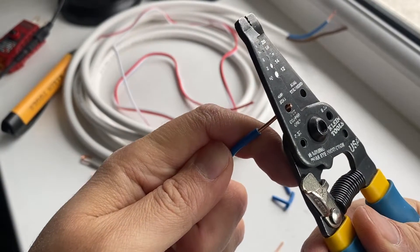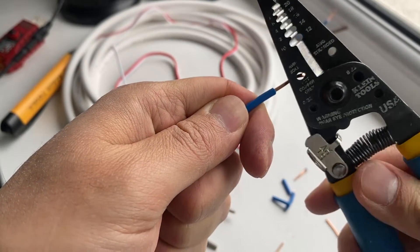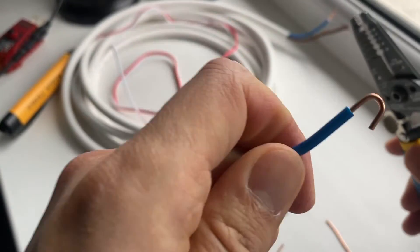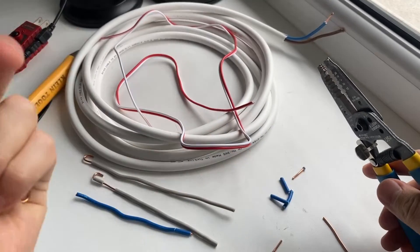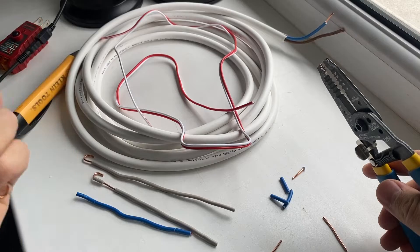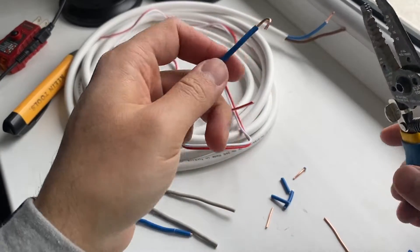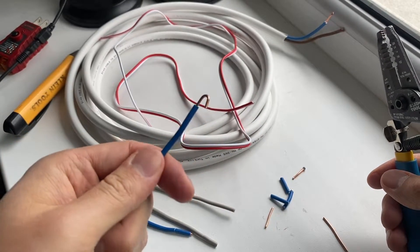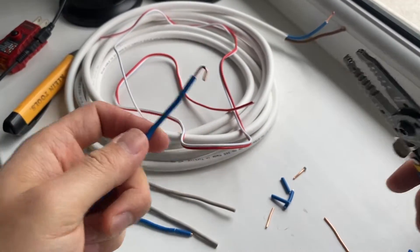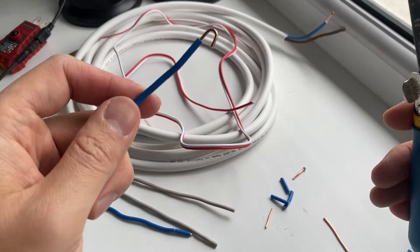If you have to bend the wire, I just use this hole right here for making a loop to hook it onto the outlet. If you're an apprentice, just practice. There's a standard size you need to cut to be able to use it on outlets, and with different wire sizes just familiarize yourself and strip it like this.